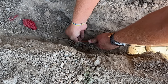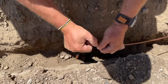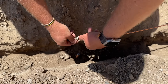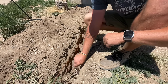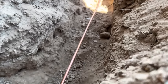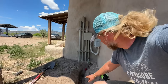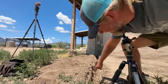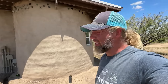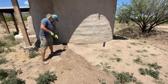Those are in. I'm going to get some tools, wire cutters, connect this copper wire and we'll finish it up. The original ground rod is connected to this one at six feet, and then all the way down to this one — also six feet. Hopefully that'll be enough in our sandy soil conditions.